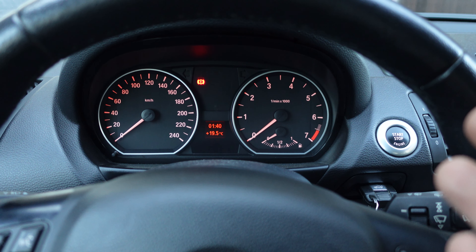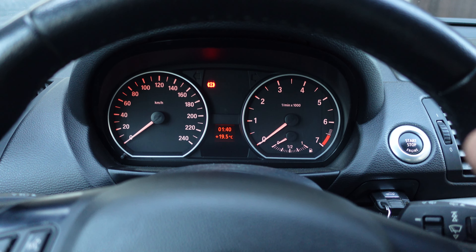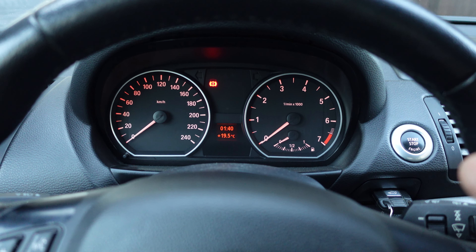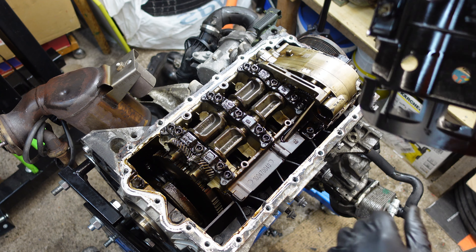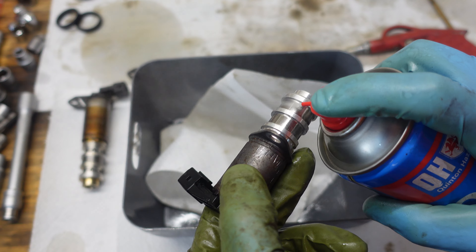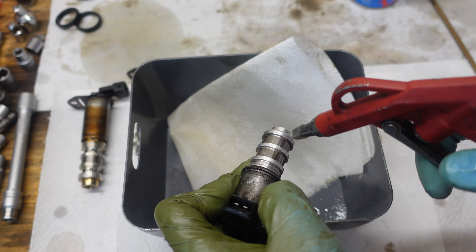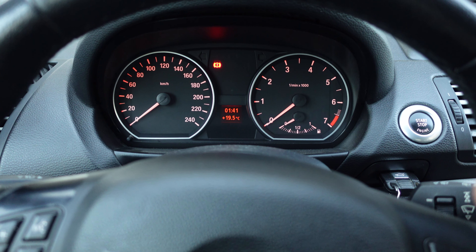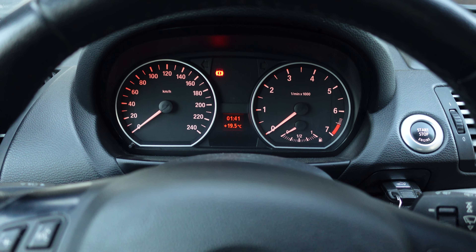What I think is happening is that in the morning when I start for work, I accidentally let the engine stall just a little bit. That causes the RPMs to drop and the oil pressure to drop below the threshold, throwing the low oil pressure warning. I know the oil pickup is not clogged because I just rebuilt this engine, but I reused the original control valve, which is probably now causing these problems. The logical next step is to replace the oil control solenoid and see if that solves the issue.